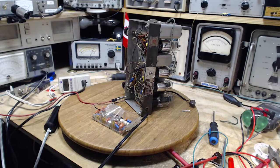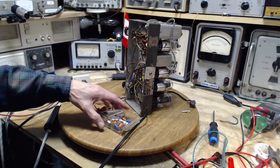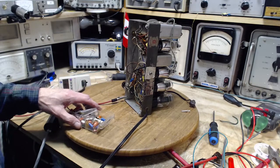It's quite possible that back in the day, the things that we can hear coming out of this radio now, hums and that, they just weren't in existence. And there's computers in here. My computer screen produces a fair bit of noise. That could easily be what's upsetting the whole situation. The radio is sensitive there, and it just happens to be in a pool full of noise signals. And no matter what I do, I'm not going to beat it out of the radio.